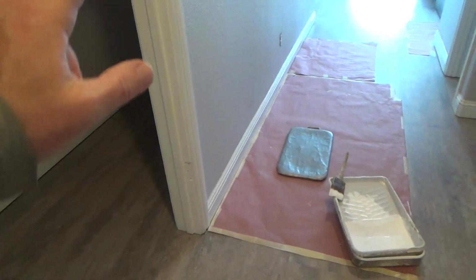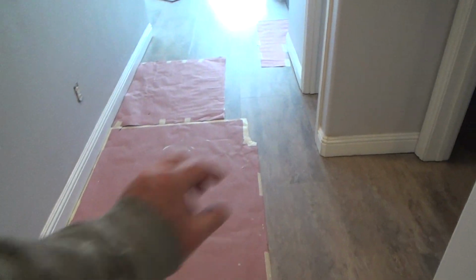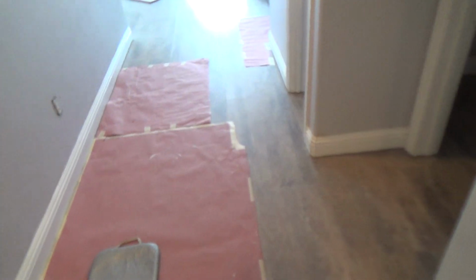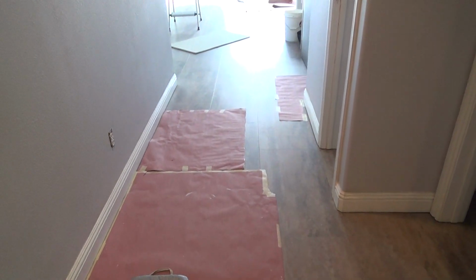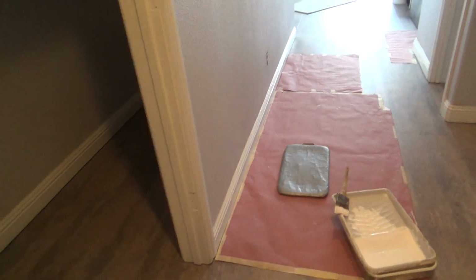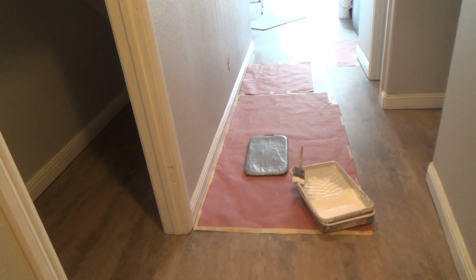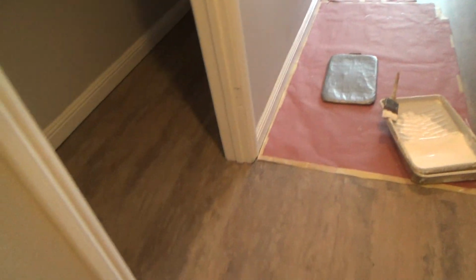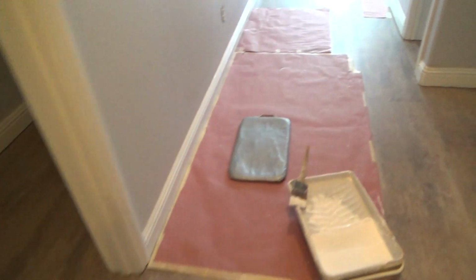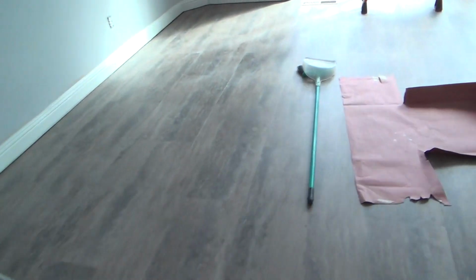on this particular floor, because it's the vinyl planking, we're gonna put a quarter round trim at the bottom. And I haven't decided yet whether or not I'm gonna use 5/8 or 3/4. Did you know they have 1/2 inch, 5/8, 3/4? I think they even have 3/8. I was thinking I'm gonna use 5/8 for sure, but there's certain areas where the base is up kind of high off the floor.